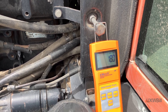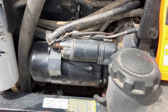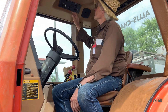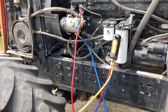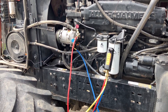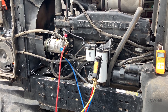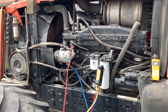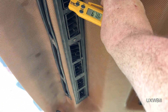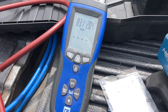We've just crossed over to one pound — a little over one pound. It almost took the entire charge under vacuum. Going ahead to crank it up and turn on the air conditioning all the way — air conditioning wide open, fan wide open. I hope we're out of gear, otherwise some stuff's going to go for a ride. Now I'll just meter the rest of it in — going down — about 68 — we're at two pounds of refrigerant right now.